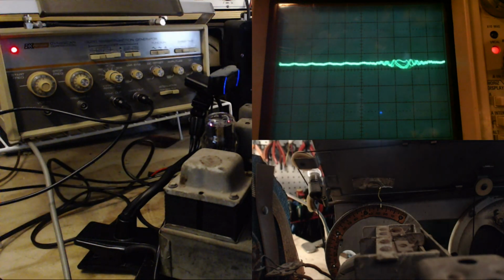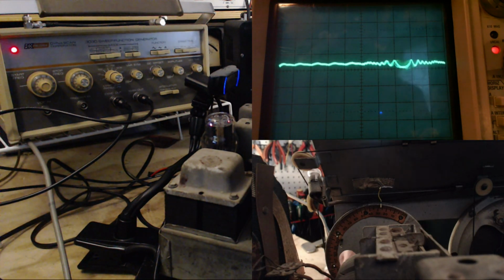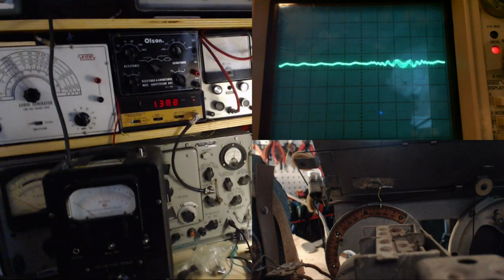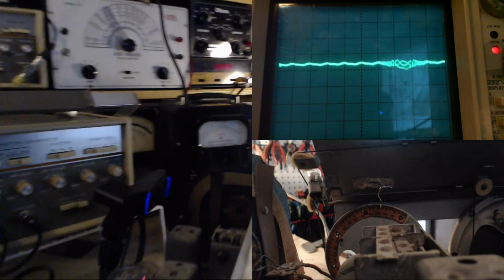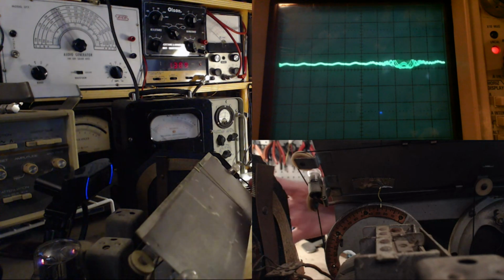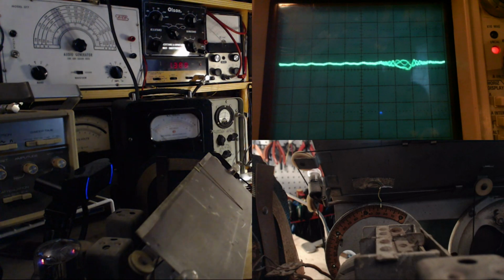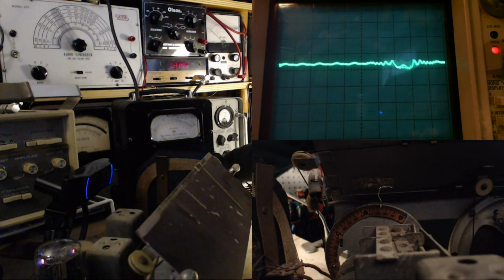Okay, so I'm not sure the funny shape here means much anymore. Maybe it does. But that's tuned in. It should be 1400. And in fact, it's 1588. So what I'm going to do, let's think for a minute. Is there anything going on here that I've accidentally shifted this radio off its rocker, so to speak? No, I don't think so. I think everything's fine. So I'll set this to 1400 and we'll jack it up.